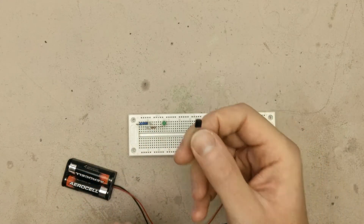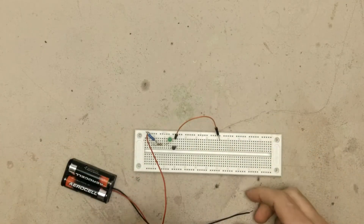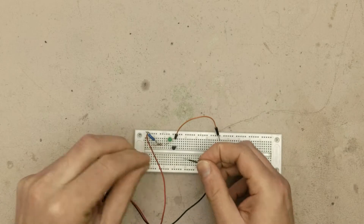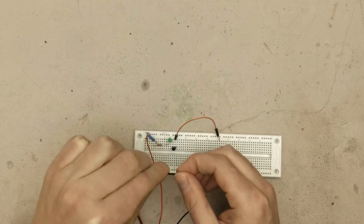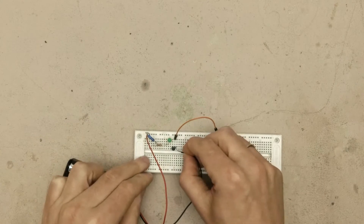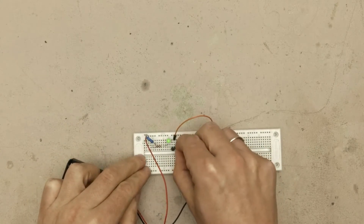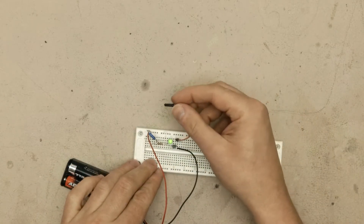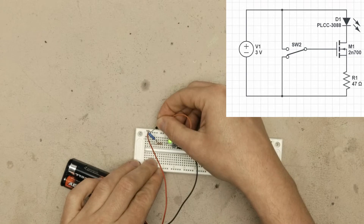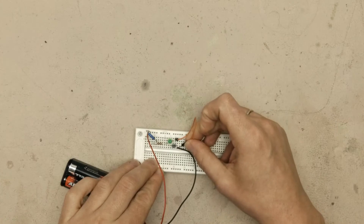What's also important is to use the MOSFET to drive all 5 LEDs, so let's put it inside. This is just kind of a switch. Now we have almost the same circuit as before. If I touch the black wire to the LED it will turn on, but I would like to use the MOSFET as a switch. So I will connect the black wire to this side of the MOSFET. By touching the middle leg of the MOSFET to the red wire I can turn the LED on, and by touching to the black wire I can turn it off.